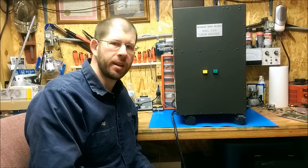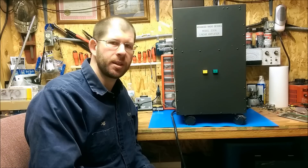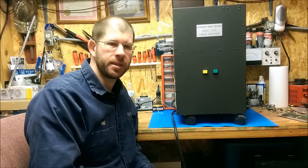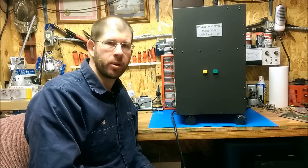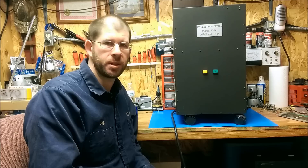My friend Nick, N9SJA, and I picked this amplifier up at Dayton Hamvention out in the flea market probably three years ago, and we haven't done anything with it really. It does work. We've used it a few times, but the air variable capacitors get out of adjustment, and it has a tendency to trip the breaker when the step start circuit goes from step start to full line voltage. It seems to have some issues there, so we are in the process of rebuilding it and refurbishing it to bring it back to its glory.